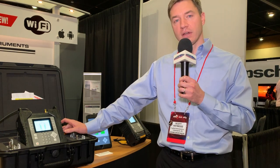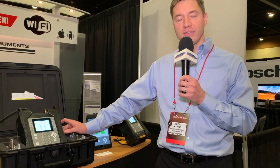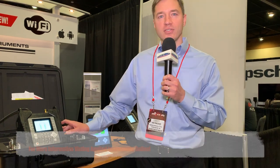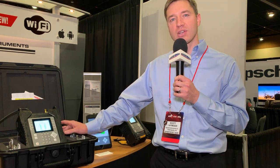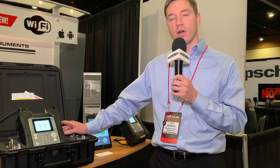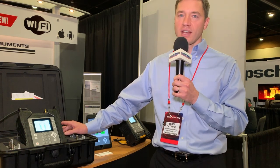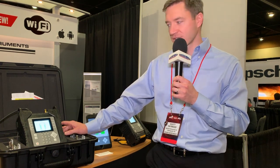We have another module available for VSAT KU band and commercial TVRO C band, and then a fourth satellite meter module for DBS, which also includes high band tuning from 2500 to 3000 megahertz for DISH Hopper 1 and Hopper 2 systems troubleshooting out of a node on the host port. The high band is outside of the normal tuning range for most satellite meters, including our standard one, so we made a version that can also tune to the high band from 2500 to 3000 megahertz.